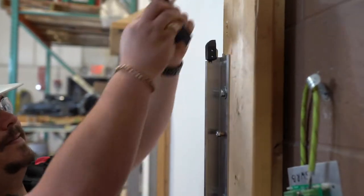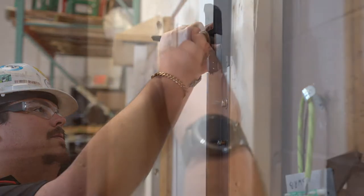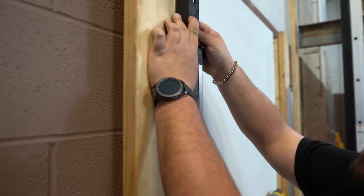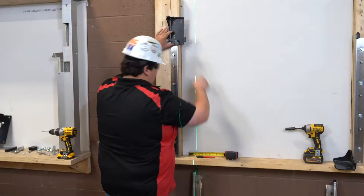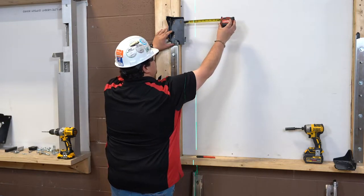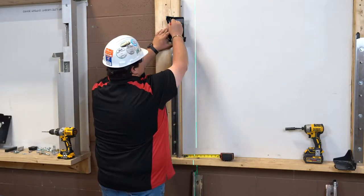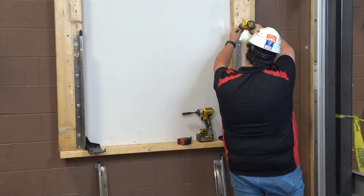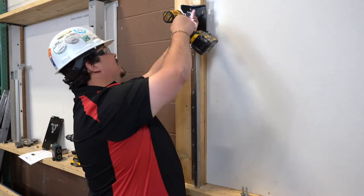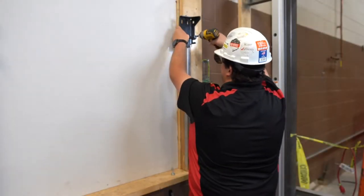Next, we will be installing the wall brackets. These brackets will be used to support the coil assembly. Start by placing the wall bracket on top of the already mounted fascia side guide while ensuring the slot on the wall bracket aligns with the tab on the guide. Be sure to check the wall brackets for level and mark the location of the wall fastener mounting holes. You will drill the mounting holes for the wall fasteners and fasten the wall bracket with the hardware provided. Check the job construction drawings for the required wall fasteners, then tighten the wall fasteners to the recommended installation torque.